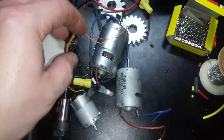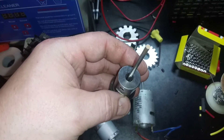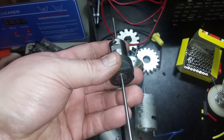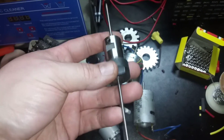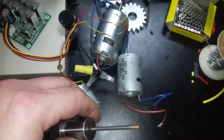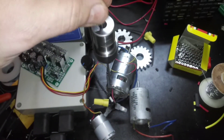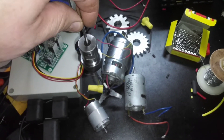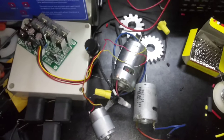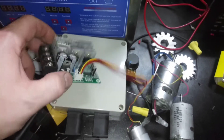These are the motors. I'm not sure which one I'm going to use yet, but ultimately I need to make a spindle that I can put this on. This is an 8mm adapter — it's an ER-16 collet — and I've got a full collet set for this, so it'll be good to find a use for it. What I'm thinking is, if I make a little spindle and use one of these motors to turn it, this can hold the electrodes for me. And also spin — because you want to spin the electrode if you can, because it'll prevent it from sticking. You don't want it to stick and grab and short out. This is going to be the speed control for the DC motor.